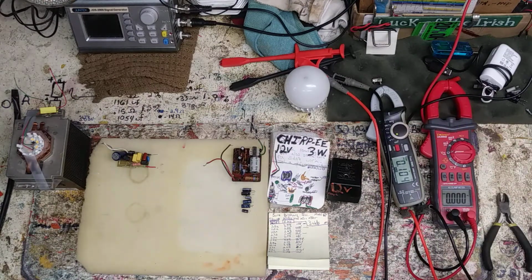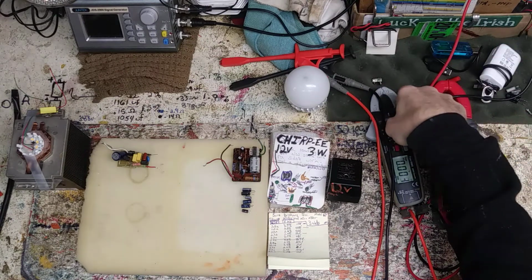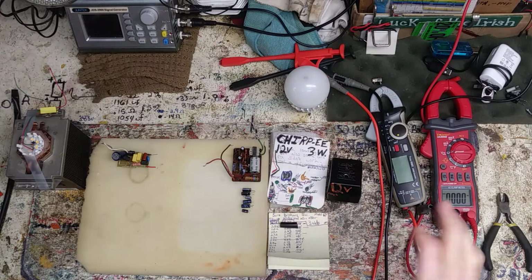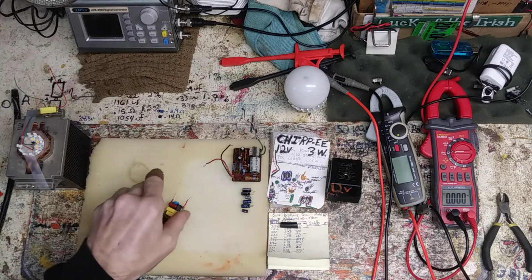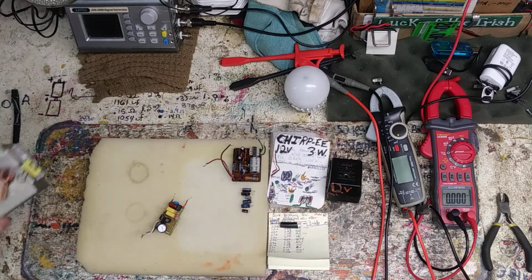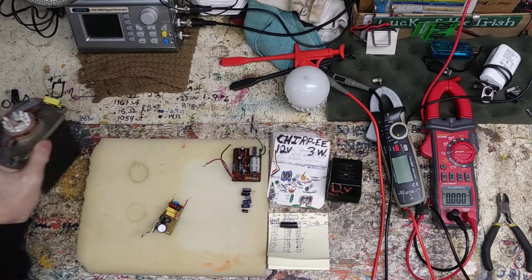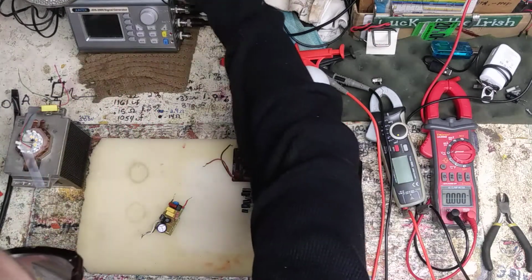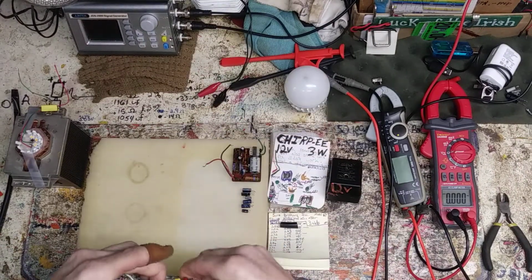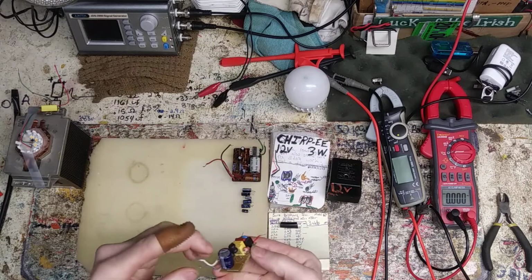I mean, it's reading 0.1 volts sitting there, so whatever. I don't know. I know when you start adding in big frequencies that they get thrown off. That's where the oscilloscope comes in. So again, here's the LED hooked up, the lights set up. Changed the capacitor, and I found an inductor that I believe would be similar to the one that was on it. And I'll get this guy hooked up.